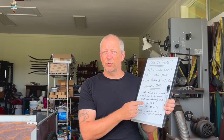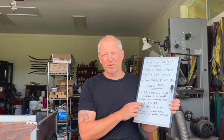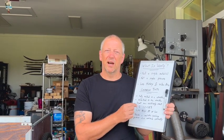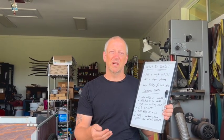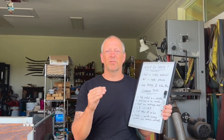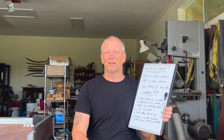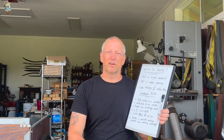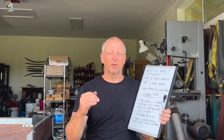Carbon content of Wootz is generally between 1.2% and 1.8%. You'll sometimes see Wootz that was very slightly lower or very slightly higher than this. But that 1.2%, right around there, is the bottom end of the range for Wootz, because Wootz requires enough carbon to form carbide banding. If there's not enough carbon, you don't have that free carbon to create those carbides. If you go back into some of my earlier videos talking about hypereutectoid, eutectoid, and hypoeutectoid steels, you'll see why that carbon content is necessary.